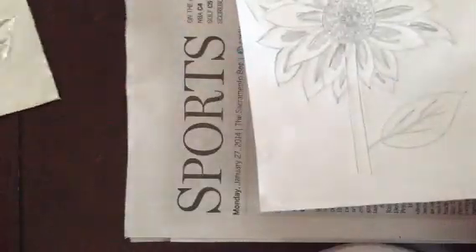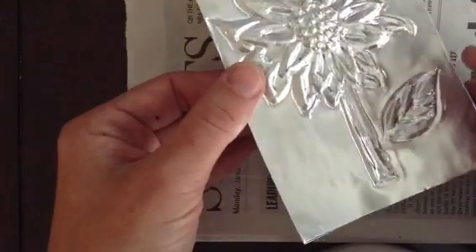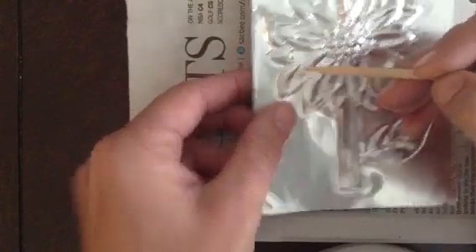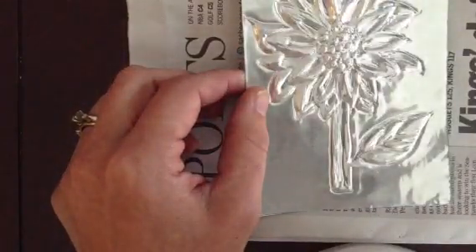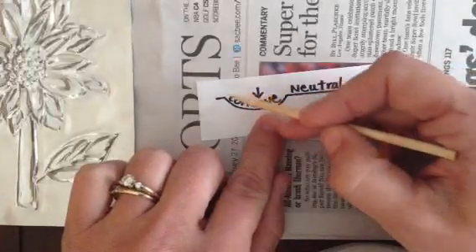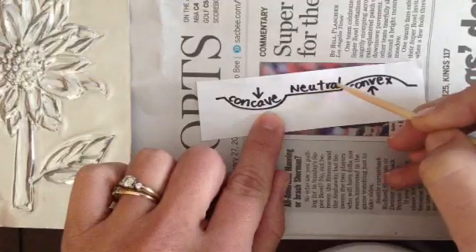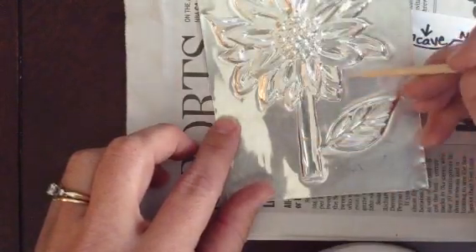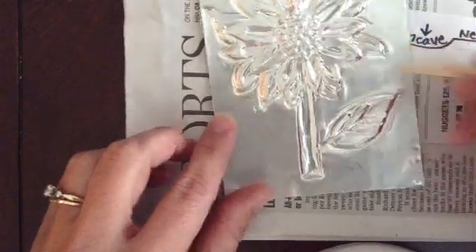You can see how some of the aluminum has been pushed out extremely and some of it has been pushed in extremely. The term for metal that has been pushed down in areas is concave, and metal that's been raised up is called convex. I remember concave by relating it to something caving in. An area on the flat plane, which is just as important when creating a repoussé, is neutral — including the lines that provide contrast between your convex and concave areas.